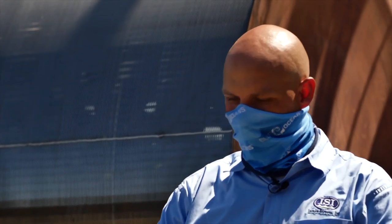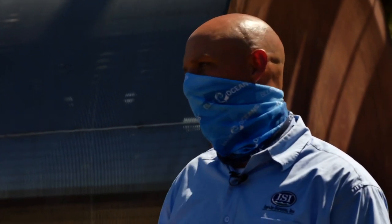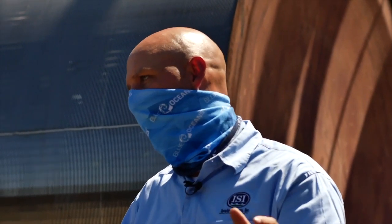We're going to have a pump in the screen, and it's going to blow water out towards the surface to create a boil to keep ice from forming along the wall. And the beauty of that is there's no plumbing. It's just the electrical cables going down there anyway. But that could be done down underneath the screen from the inside out, to induce flow.